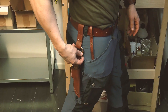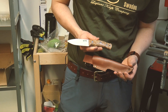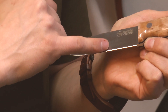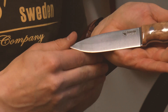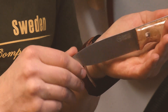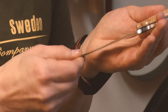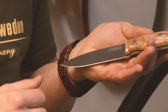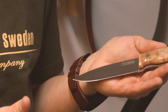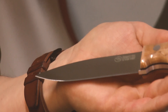The other type of grind in our range is the full flat grind. This is our number 10 knife — it's got a full flat grind on the stabilized version. You can see that the grind starts all the way at the spine and then gradually becomes thinner and thinner towards the edge. This is the same type of grind you have on a kitchen knife, though the blade here is thicker to make it stronger. This grind excels at cutting and slices very well, making it particularly good for skinning, game prep, and cutting meat.